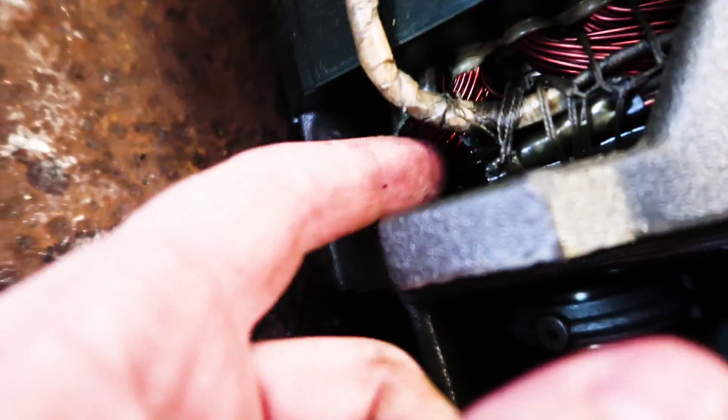This has two pistons. I'm looking at all these bearing surfaces for signs of copper plating — I'm not seeing much. I'm seeing some copper material, so that doesn't look too bad. You can see the windings are definitely cooked on the inside of the motor. That binding you see isn't the winding itself, just the binding material, but you can tell it's been hot — it's cooked. We've got our thermal overload right in there, and that's what that connector is, with open connections immersed in refrigerant and oil. Looking in there, you can see the windings are in really bad condition in that area as well.